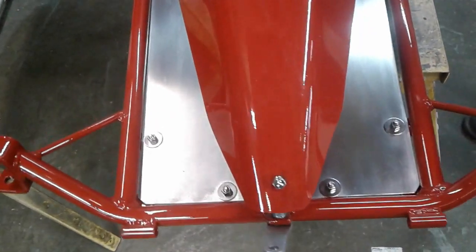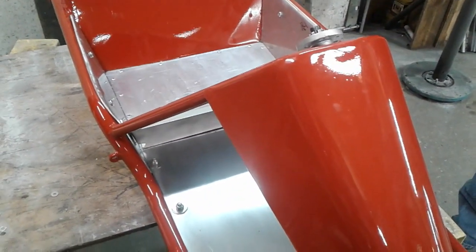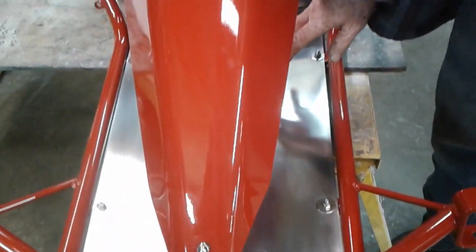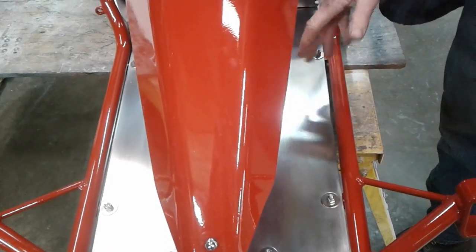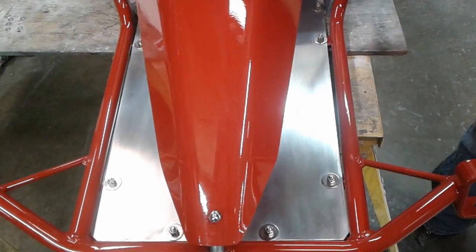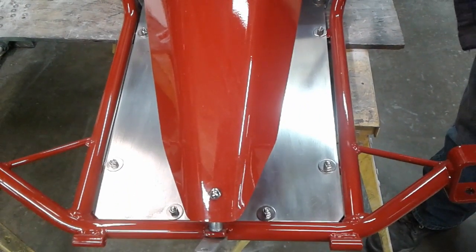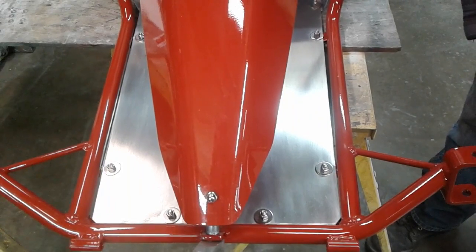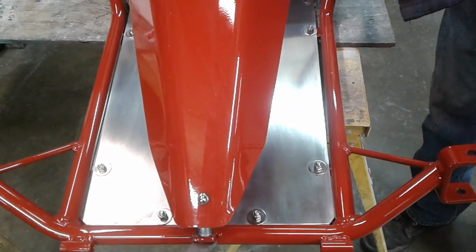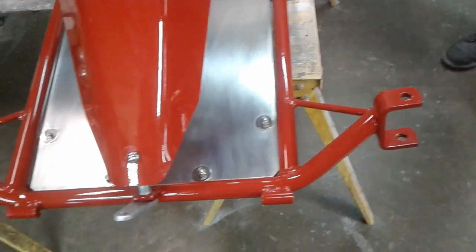So it's another alternative if you don't have a buffer available, but you don't like the standard aluminum look of a sheet of aluminum. This is an easy option. Doesn't take you any time at all to do it. I sanded it with 320 paper first. If you got really deep scratches, you could use something more coarse than that and then go to 320 and then go straight to WD-40 and steel wool. The 320 wet paper, you use that with just water. So there's another option. Yep, well, it looks good.